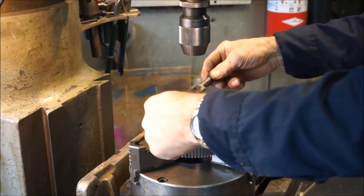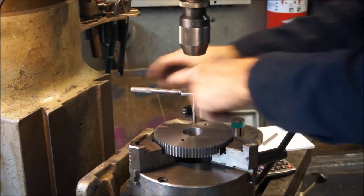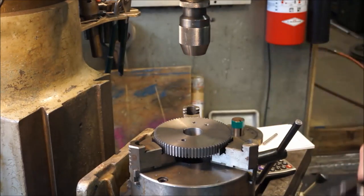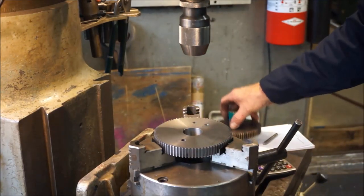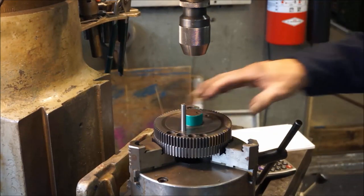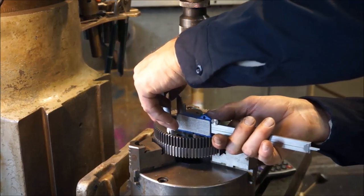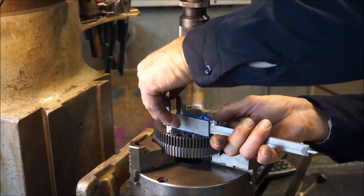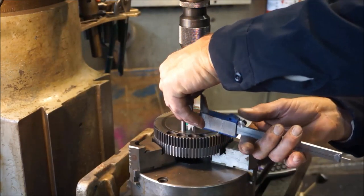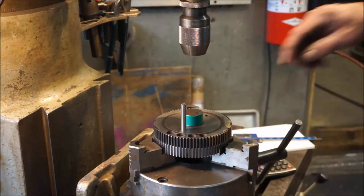Okay, and bring it back out again, and I'm actually about an eighth of an inch of actually touching that jaw. So I did a good job on stopping that. All right, now we got those two holes in there. And here's my pin back into the tight hole. All right, let's measure those holes there. These are half inch: 480, 490, 493, 494, 492.